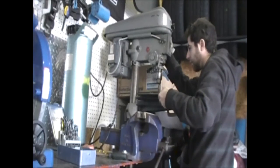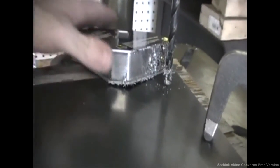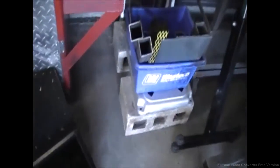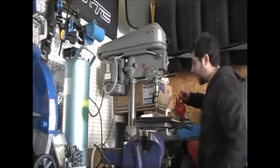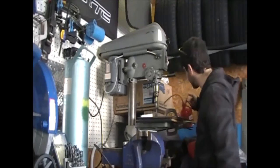I measure an inch and a quarter from the corner. I got all the corners center punched as you can see, and I'm gonna drill. What I got going on here is a welding magnet with an off and on switch, so it keeps the filings from getting all over the ground and always making a mess. You put the magnet there and flip the switch off when you get over to the garbage — makes for easy cleanup. Now we're gonna do 9 sixteenths. I like to keep my drill bits lasting, so I use a little oil — it makes the drill bit last twice as long.